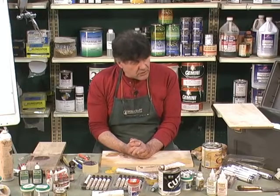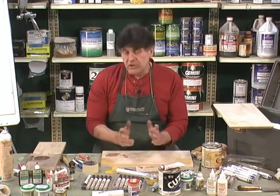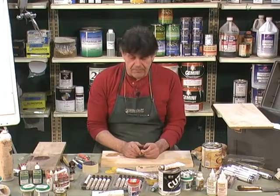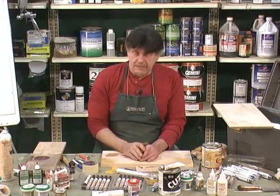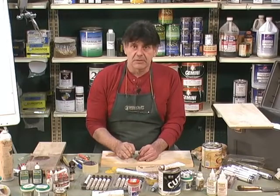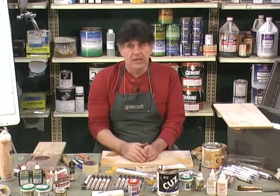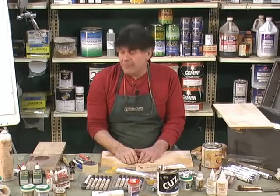This is one of those things that you're going to have to go back and watch several times to get everything we've talked about. There's so many variables and so many variations, it's just impossible to address every scenario. And I'm going to leave you with one last tip. If you're dealing with MDF, okay, there's nothing faster, slicker, quicker, or easier than a little bit of body filler in nail holes, screw holes, and whatever. Holds great, tenacious, sands off good, doesn't shrink back, and you're done. That pretty much wraps us up on this one.